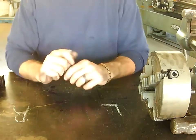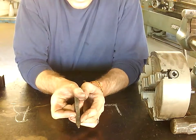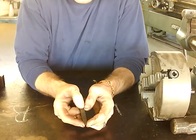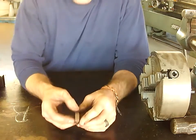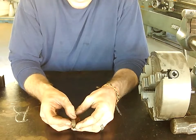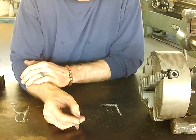Different types of tools for the lathe are literally endless because you can make all your own tools. We have tools called forming tools — this one right here has a rounded, blunted end that could be used for making grooves for a pulley or something like that. We can grind it down to any shape we want. Tools like this have a pointed edge ground to a precise degree so we can cut threads for bolts — we can make our own bolts. So we have tools specific for threading.